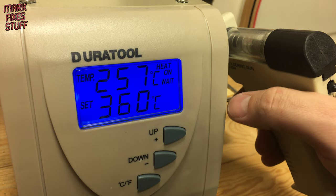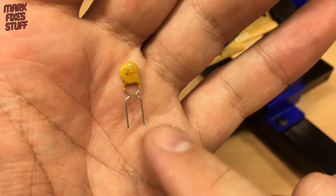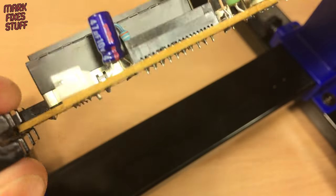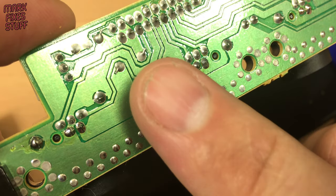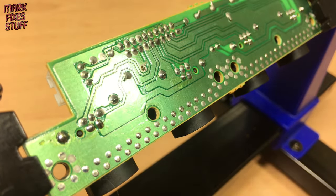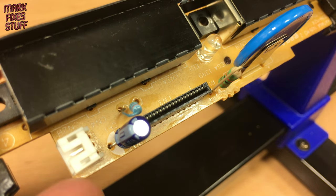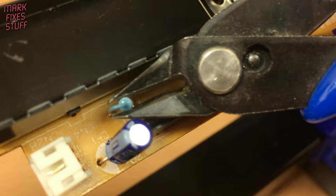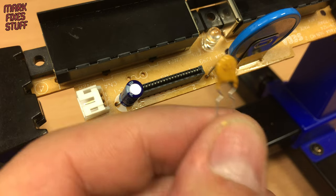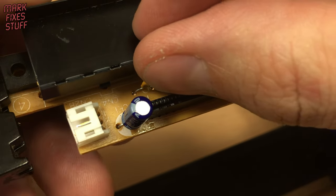Let's heat up the desoldering gun and crack on. First, we'll replace that pesky fuse. The replacement is better because rather than being a single-use fuse like the installed type, it's a self-resetting part — if you blow your ports, you can switch off, wait a minute, and the fuse will self-heal. I'm using a desoldering gun, but a standard manual solder sucker will work fine. Looking at the removed fuse, we can see that it's actually a fusible resistor. We'll replace it with a 72V 400mA poly switch resettable fuse. It's simply a matter of swapping the components.